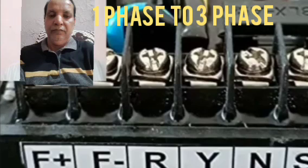You can see the F plus and F minus — two wires will be coming from the excited rotor. This will be fitted into the F plus and F minus. The three phase alternator has three wires for R, Y, and B. Only two wires have been coming from R and Y, and one is the neutral, which has been fitted into this AVR. So it will be converted into the three phase.